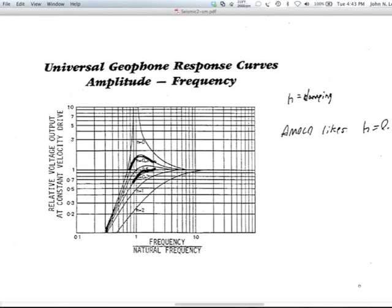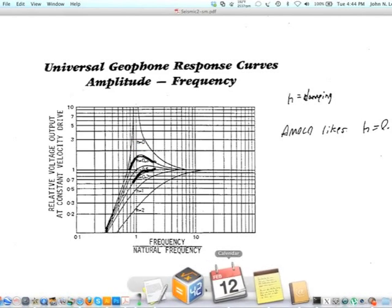And there's also a damping factor. There's a little shunt resistor in there that goes across the coil that helps you bleed voltage out, and that acts as damping. If you just had the spring and the coil, then it would wobble up and down forever. If there was infinite resistance between the two ends of the coil, there'd be no energy transmitted and no damping. So that would mean, with zero damping, H equals zero, which you may or may not be able to see here.